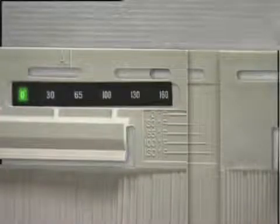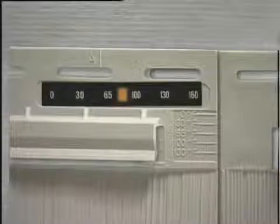If the panel temperature is 0, align the second panel to the 0 temperature indicator. If it's 30, set it to the 30 line, and so on. If it indicates a temperature of 160, butt the panels tight. Anytime the temperature cell is brighter between two temperatures, position the panel so it's between those two indicator lines.